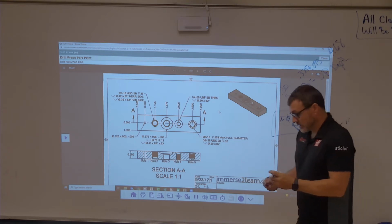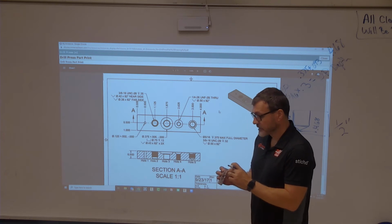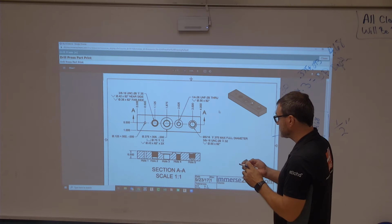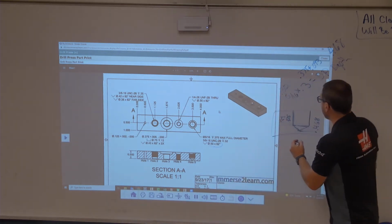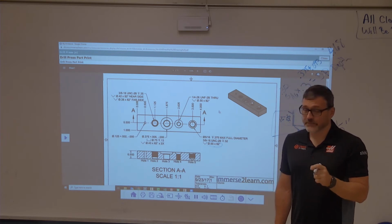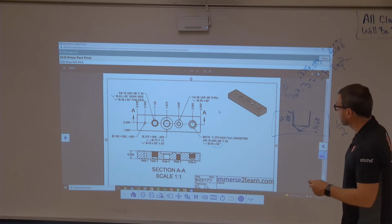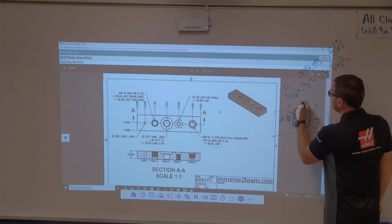Then, the taper that you put on there should be 82 degrees. And so it should come out to a 1/2 inch diameter at 82 degrees. So it cannot be a center drill, it's gotta be an 82 degree countersink. Okay, countersink is different than counterbore. So that means that you would check that here at 500 thousandths diameter, or 1/2 of an inch.